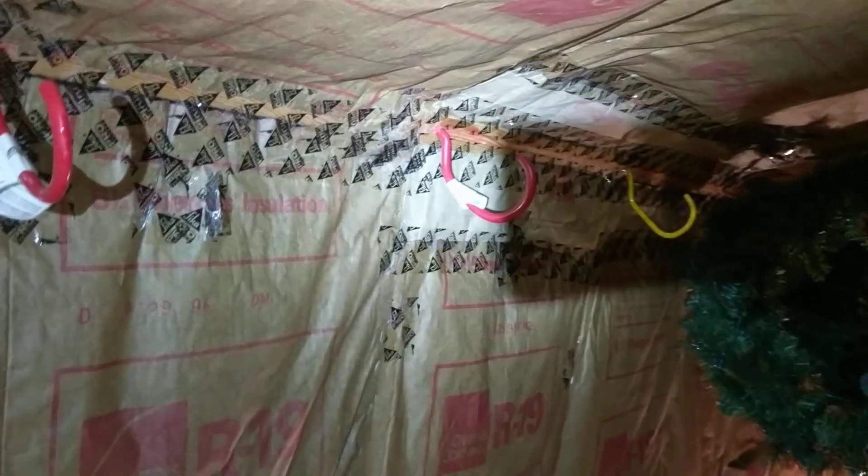I was originally afraid of not venting the attic, but now I've more or less given up on that idea — I'm going to have the attic unvented as if it were a finished attic. If I do need ventilation in this attic at some point in the future, I'll probably add a vent to the end wall to vent the attic itself. Right now the ridge vent and the soffit vents are only being used to ventilate the roof deck, which is the primary ventilation requirement because that's where you'll primarily get a problem with condensation. Anyway, that's just a little update on this project — thanks, bye.